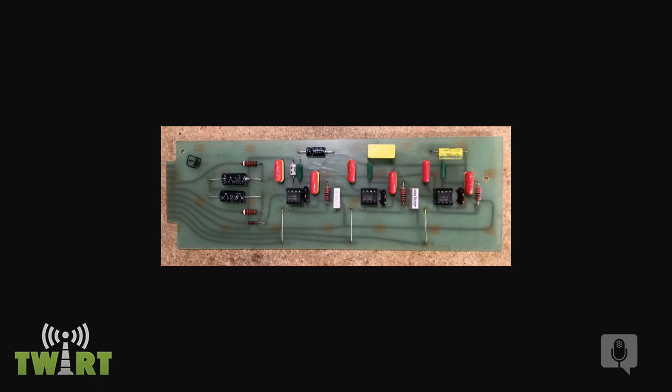Other problems include bad op amps and units that have been modified. Mike always restores to stock — he wouldn't even do a modification if asked. But without doubt, the number one problem is alignment. The alignment is like brain surgery: if you know how to do it, it's not tough, but you need experience and a distortion analyzer. The DAP 310 manual does cover alignment, though the version on darow.com was incomplete; Mike put together a complete high-quality scan of the manual.